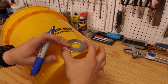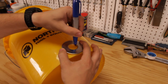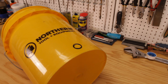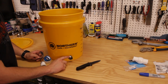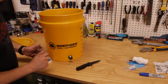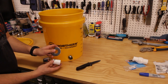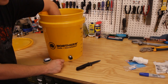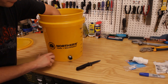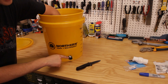We're gonna figure out where the pipe will start and do it right here. I'm gonna use the marker to trace that line. Cut a hole, go ahead and screw in the nipple, make sure it's nice and tight on the sides. Now we're gonna take our washer and our end piece and put it on the inside — washer first and then the end piece. Make sure you have pipe tape on the inside on the thread and on the outside on the thread as well.